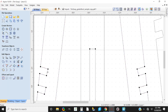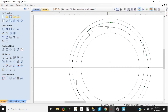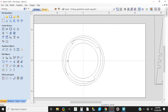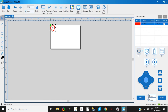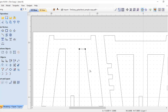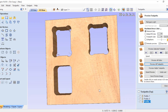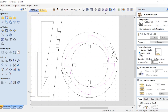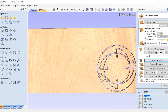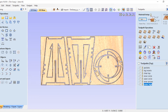So back to the drawing board — we're almost there. I went back to the Vectric file and created a sort of saw-blade-type shape on the inside. I had to do some math to figure out the width from the top for the widest part of the stool as well as to the smallest part. I also added my arrow flair to the shape of the cutouts — I use a lot of arrows in my branding and I thought it looked cool. I ran some test cuts to make sure my quarter-inch end mill would be able to handle those eighth-inch dog-bone corners on the stool top, and it all seemed like it was going to work, so I created some tool paths and cut it.